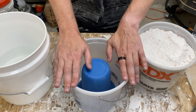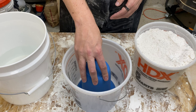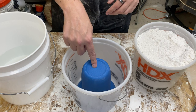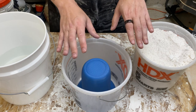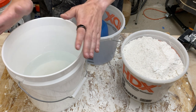We need to figure out how much plaster needs to go in here. I know my bucket here is five liters to the very top, and we need to subtract out the amount of space taken up by our mold. Because this is 3D modeled, I can actually use the 3D model to figure out the volume. I went into my 3D software and pulled out the volume — it turns out this is 1.33 liters, which covers both the volume of the form for the pot and the slip well. So we do some math: 5 liters minus 1.33 is 3.67, and I'm going to round that up to 4 to have some buffer. To do 4 liters worth of plaster, I need 4 kilograms of dry plaster — it's basically a 1-to-1 ratio, that's why we're measuring things in liters. And then it's a ratio of 70 parts water to 100 parts plaster, so we multiply 4 by 0.7, which gives 2.8 liters of water. Here is the 4 kilograms of plaster and here is the 2.8 liters of water.